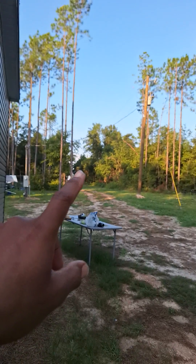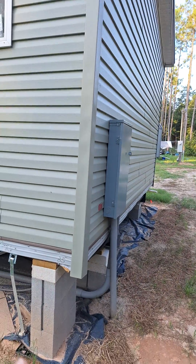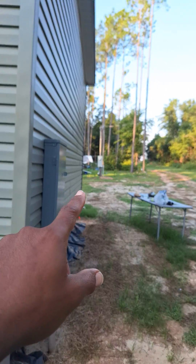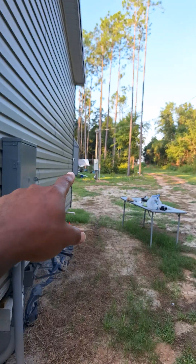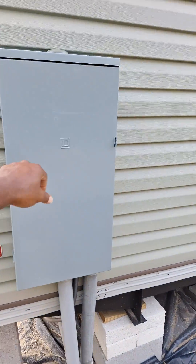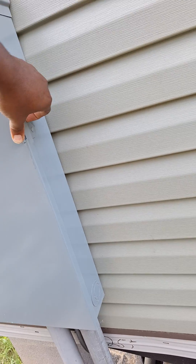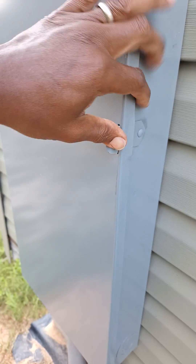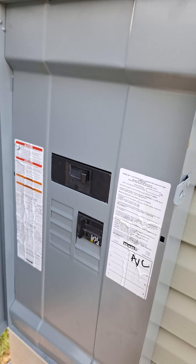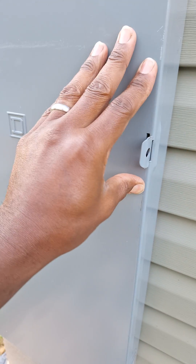One thing to keep in mind is they generally want this pole to be in close proximity of the manufactured home. In this case it was not, and so therefore, 35 feet or more, they have to install a panel box. So this one right here has a breaker in it — an external breaker box. This was installed because it's more than 35 feet. So that's one thing to keep in mind and look for, and this is the state of Florida.